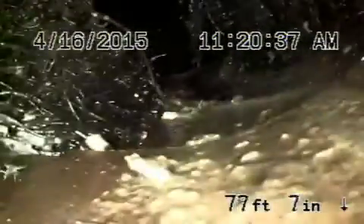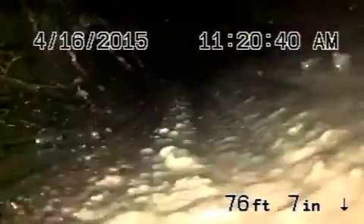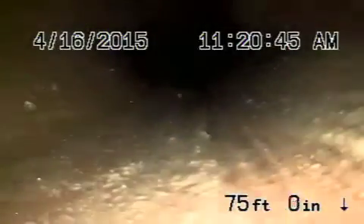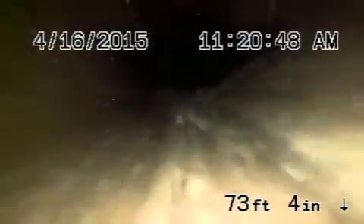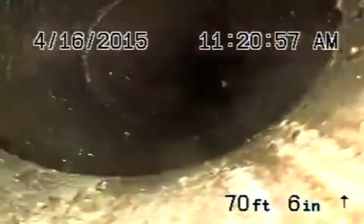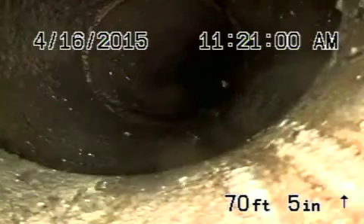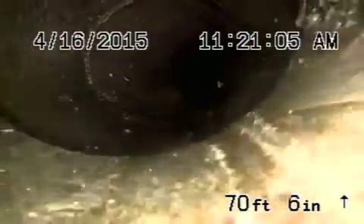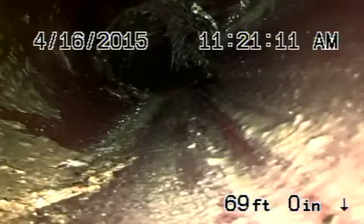You can see there are minor roots here in the six-inch that could be cleaned with a hydro-jetter, but it is minor. Here we are at the six-by-four transition at the property line — this is five feet deep, right next to the sidewalk. I put some green paint at this location. You can see there is a root coming in through the test T, hanging in from the top there. Very common to have roots there.